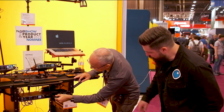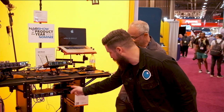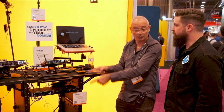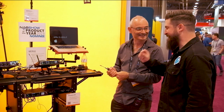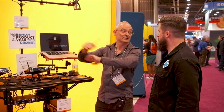The power station has holes so you don't have to take antennas off, and you can fit two transmitters per slot — including ones with the battery doubler fitted, up to a maximum of four. It also acts as a way to get all your recordings off the transmitters via USB-C on the back. It has timecode so you can jam all your transmitters, and actually if you plug timecode into the back and set your transmitters to record mode, timecode is sent over Nextlink automatically — no setup needed.